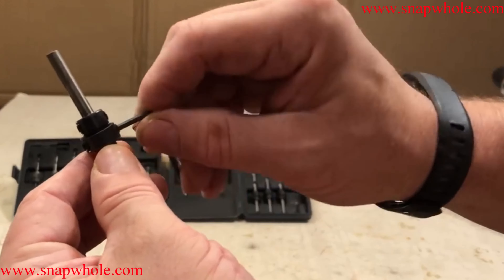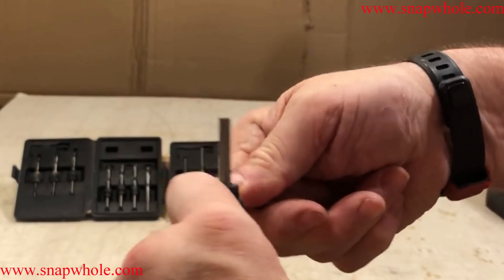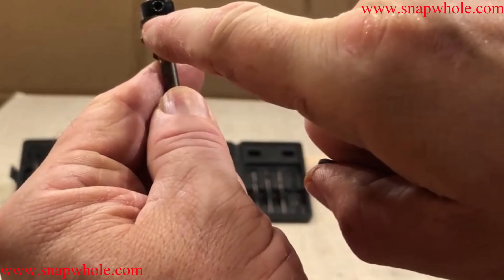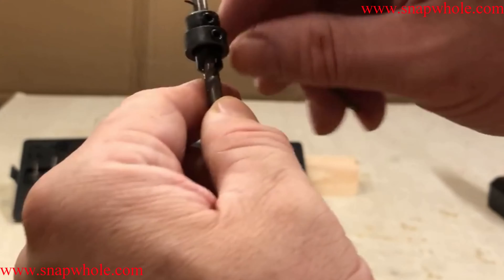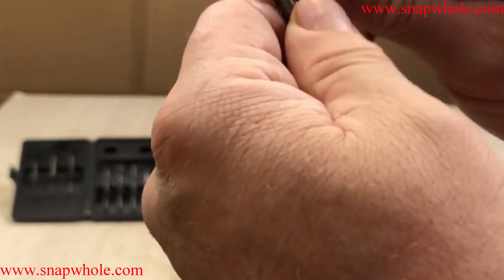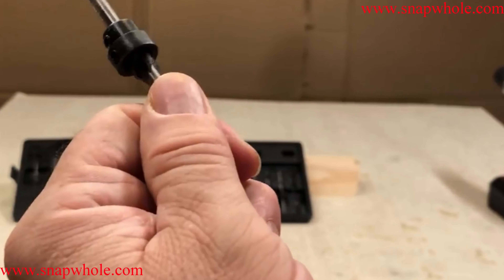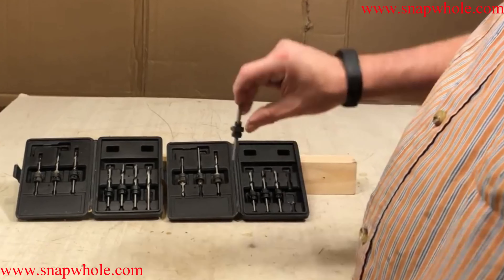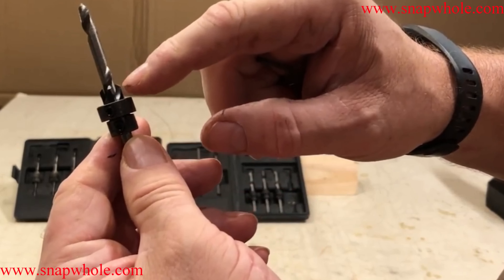Set that where I want it and tighten it up. By default there's a problem with this — as you tighten it down by twisting, it cants the collar to one side. So you kind of have to combat that as you put it together. It's very versatile in how you can set it up — you can set how deep the pilot hole goes and how deep the countersink itself goes.